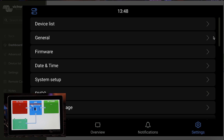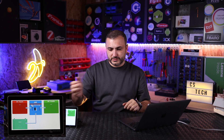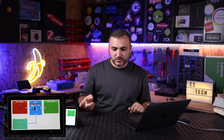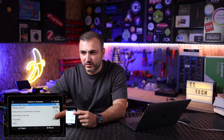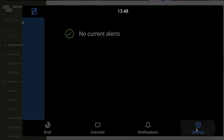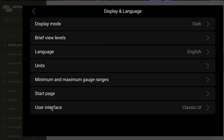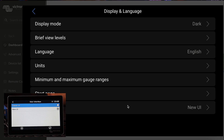The system will run either the old or new interface in VRM - I choose the new interface. I can scroll through the menu; I don't have any devices on this demo unit, but I can make all the settings. Everything that runs on the GX will also show on my screen. On the LCD you still have the option to use the old interface, but I recommend installing the new one too. You can do this manually by going to menu, then settings, then scroll to display & language, and at the bottom you have user interface where you can select old or new. You can also do this from your web browser in the settings under display & language - user interface - and select new UI.